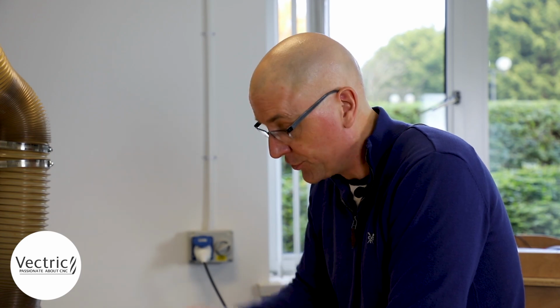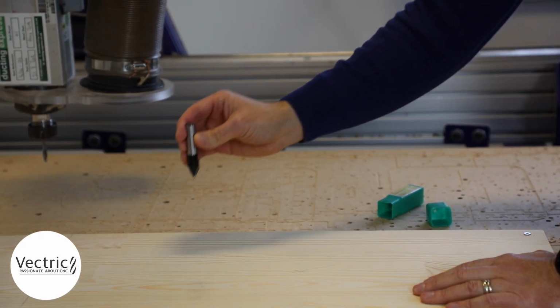Perfect. So that's where we're going to use the fluting toolpath to actually cut the edge of the sign so it looks like it's kind of chopped out of ice. So the tool will go along and dip down deep in the middle of the vector and then pop out at the end. So we'll get that nice sort of up and down motion.